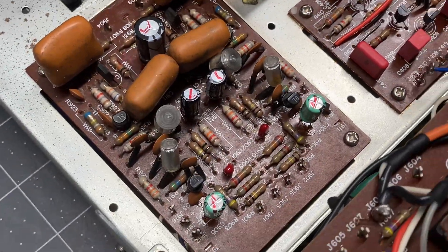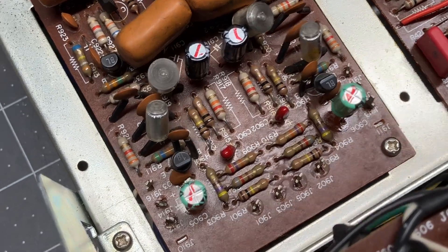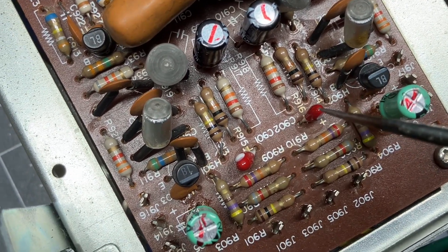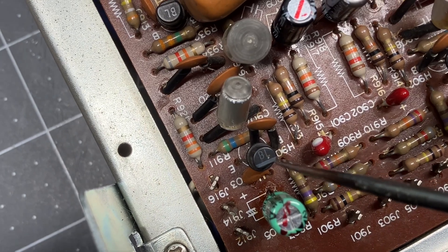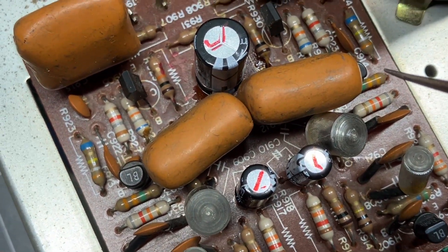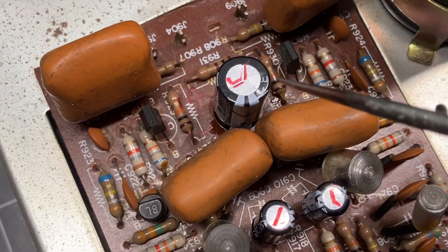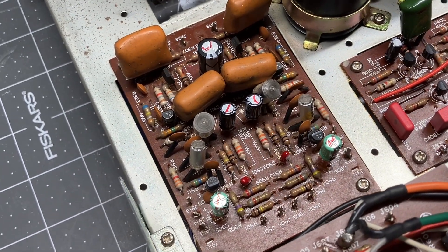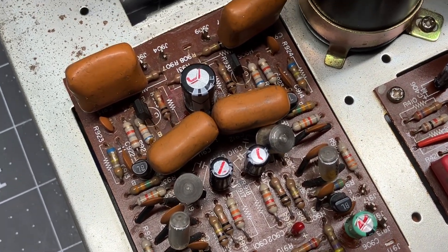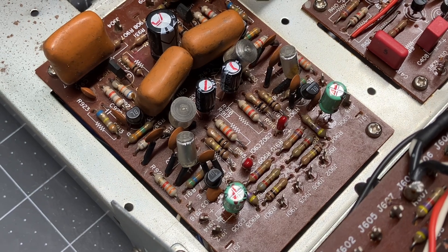In this video we're tackling the P900 Phono preamp and there's not a whole lot we're going to do. We're going to replace this transistor here, these tantalums, this one, this transistor here. We may remove this one, that cap there, and there's a transistor hiding over here. And of course the main power can, this transistor, that transistor, and that transistor. So that's about 12 parts or so. The big brown ones we're going to leave those. This will go pretty quick.